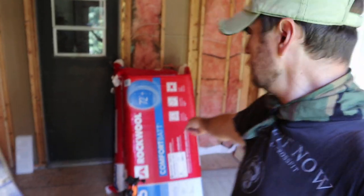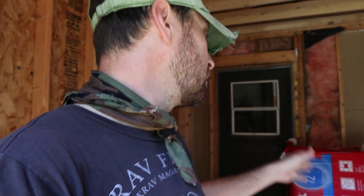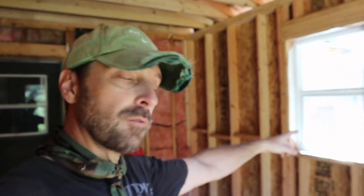We're going to be using this door and moving it over here. I recently bought our insulation — I'm going to finish out the whole interior: floor, drywall, insulation, all that stuff. We're going to be putting up our baffles and doing rock wool. The reason I like rock wool is its R-value is a little bit higher and it is fire resistant up to 2,000 degrees. It also won't mold if you get water behind the wall for some reason — it just won't mold. Yes, it's more expensive, probably twice as much, but the peace of mind — especially for this space — is worth the cost. We've got a small window and a window in the door, so that'll give us plenty of light.